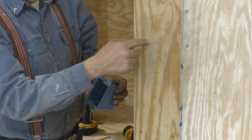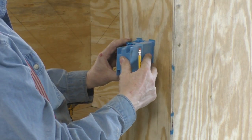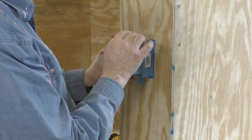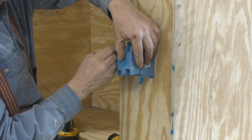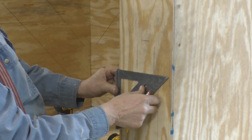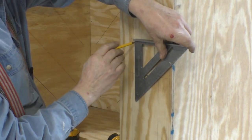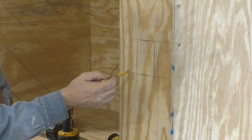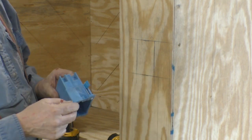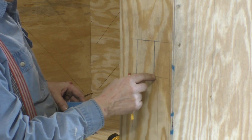So what you got to do is cut a hole. The way you do that is you mark it out with nice dark lines so you can see what you're doing. It doesn't have to be really accurate. Take a speed square — just want it square. You want the hole a little bit bigger than the box; the box will slide in but you don't want it sloppy. The corners are usually the worst, so what I do is drill in the four corners with a pretty good-sized drill bit so that little corner will be oblong a little bit.